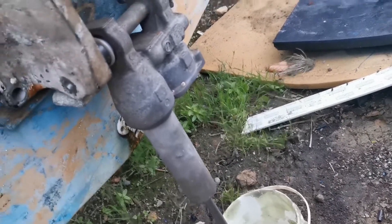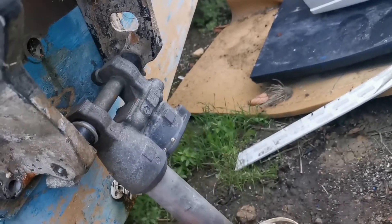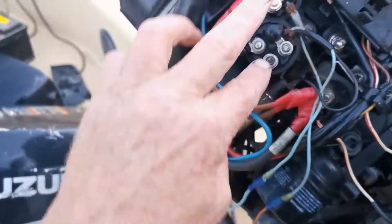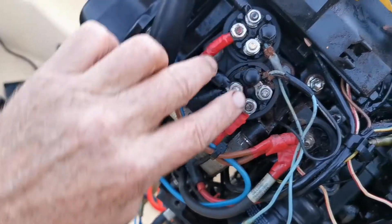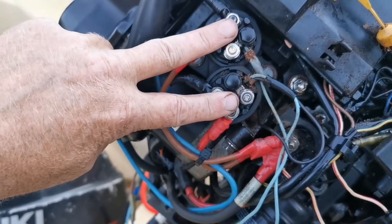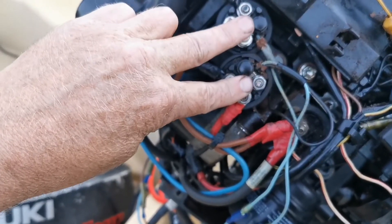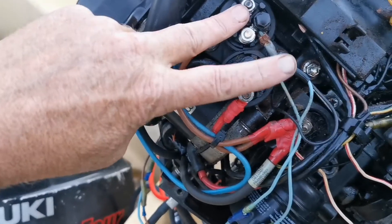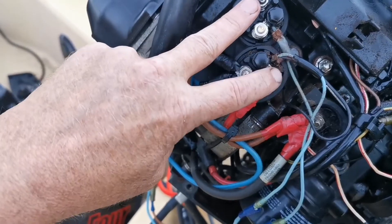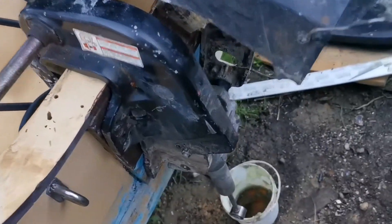One of the problems is the trim/tilt motor. I'll short it out on the solenoid so I can tell — there are two solenoids here. With the solenoids or relays, they're set to neutral. When you drive one, it puts a live wire to it. When you release the switch it goes back to neutral, then pressing the button the other way energizes that relay, sending live down that one — basically reversing the polarity on the motor to spin it backwards and forwards.